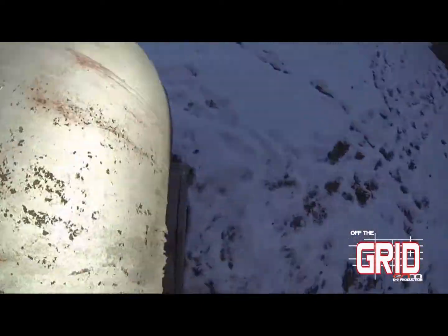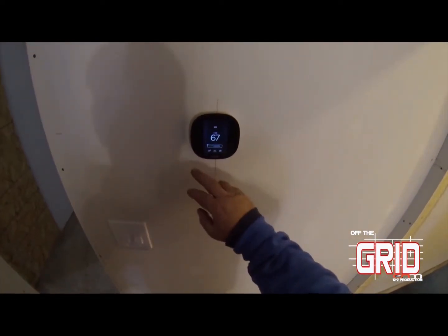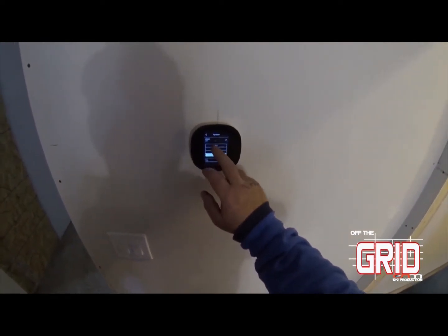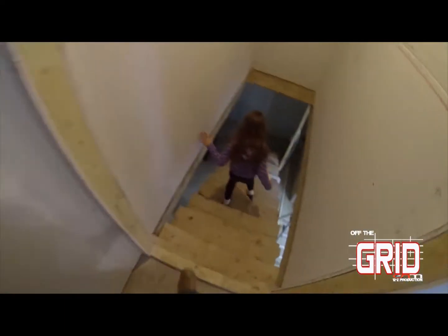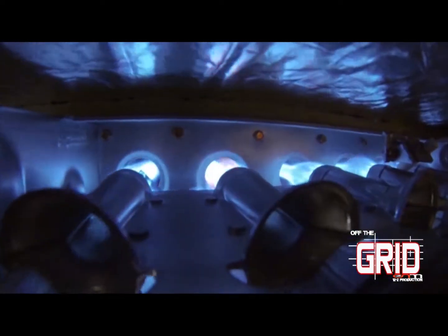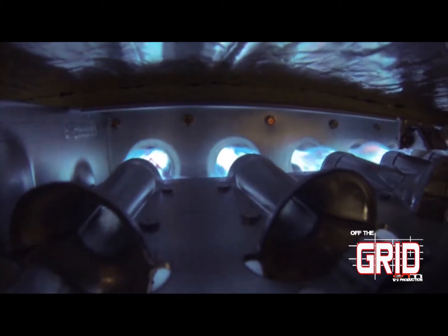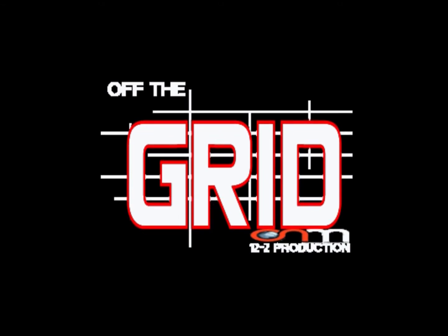We'll close the lid, put the lock on it, and head back indoors. Once that's done, go to the thermostat and turn it back on to reset the system. I bought a new Ecobee thermostat, which is a Wi-Fi thermostat — you can check out my review on the Off The Grid page. Once that's up and running, we head down to the basement, fire things up — look at there, got a nice blue flame. We are now providing over 160,000 BTUs to my 100,000 BTU furnace. Things are good. We are done.